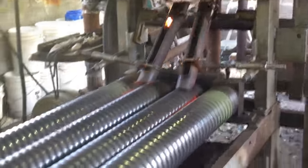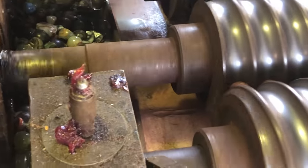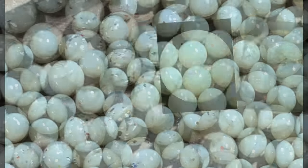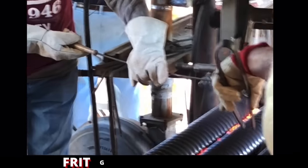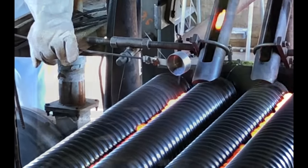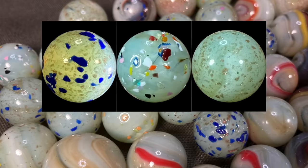The glass slugs are thrown into two tubes which direct them onto the forming screws, and the glass solidifies quickly as they're shaped into round marbles by the rotating screws. They continue down the track, roll under some cooling fans, and are met by our quality control crew at the sorting stations. The very first marbles out of the tank are referred to as tank wash marbles — undecorated, plain Jane marbles that show the base glass color. Then right away, detail specialist Jim Storrsberg begins decorating the marbles with frit glass using specialized hand tools right at the rollers, and aventurine lines right before the cutting shears at the orifice.